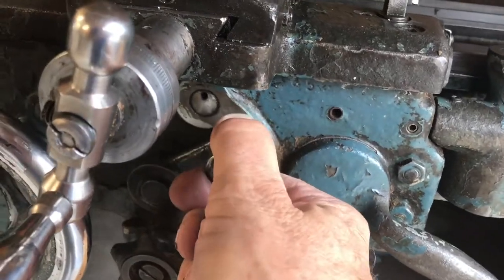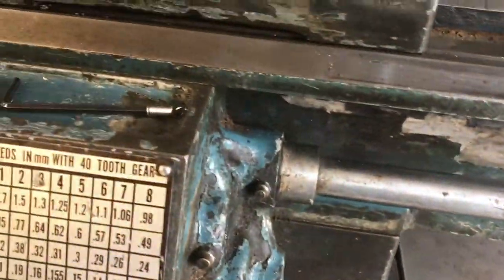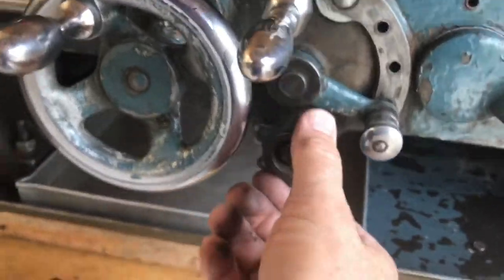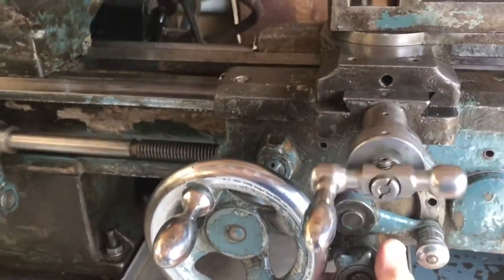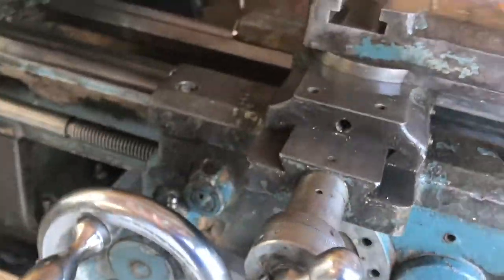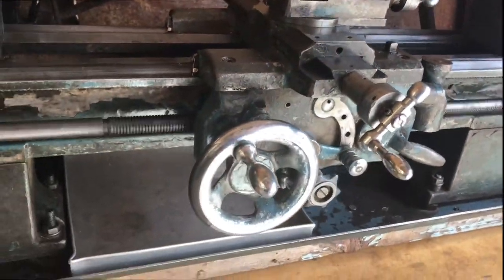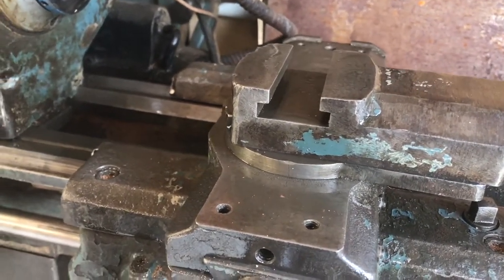The saddle is the part that slides directly on the bed of the lathe. Sitting on top of that are the cross slide and compound slide, which make up the carriage — they carry the tool on the top of the whole system. The part that hangs down the front, where you've got the clutch and the big wheel for longitudinal movement, is actually the apron. In different countries people refer to the whole thing loosely as either the carriage, the saddle, or the apron. The fine control here, instead of moving the whole apron, just moves the tool holder.